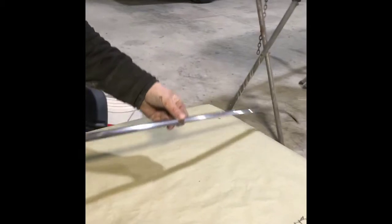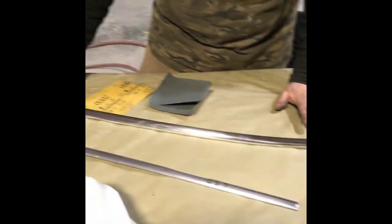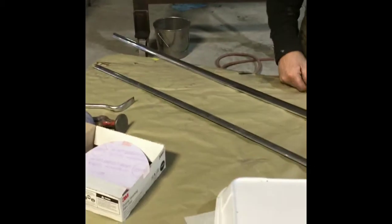Now this has been all sanded and it has not been polished yet. It's sanded all down and cleaned, and I'm going to be going over working on a few little tiny waves left in it that the glossing of it by sanding it, wet sanding it, cleaning it, shows me other little mild imperfections in it, and I'll finish taking them out. I've already worked out quite a few of the dents out of the straight piece. I'll be filing and sanding on those next.